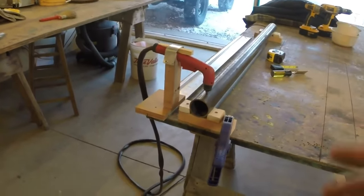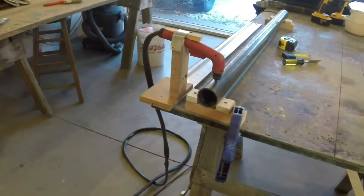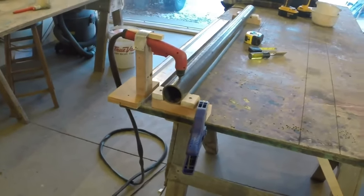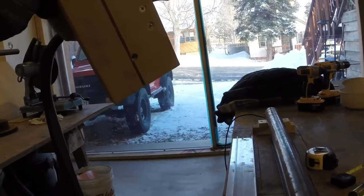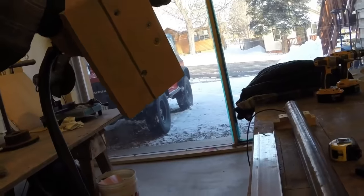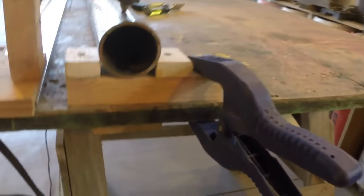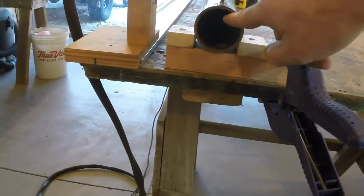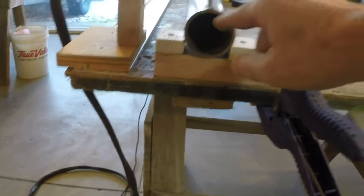I would have this form set up to pour any extra into this form or a form like this for storage purposes, I suppose, rather than having a bunch of those biscuits around. Anyway, it's an interesting thought to me, and I've set this up so I can attempt a relatively clean cut. I have a piece of plywood with a slot cut in it that matches this slot. I've just clamped this piece down, but raised it up so it touches this. You'll notice that little nub is lined up underneath my cutter. I'd like to get rid of that nub.